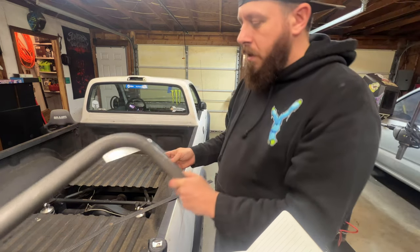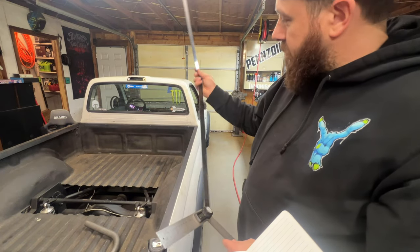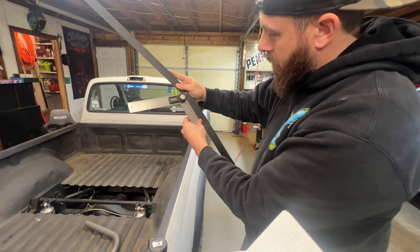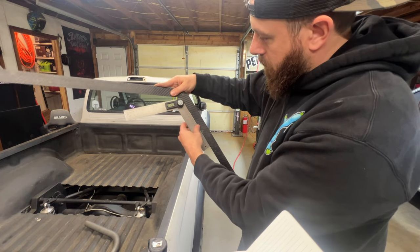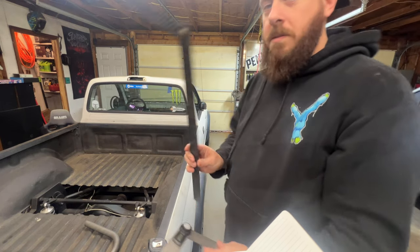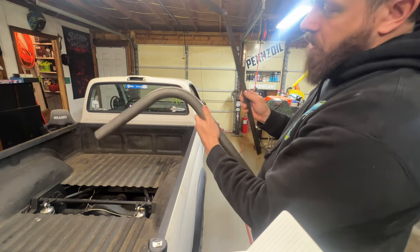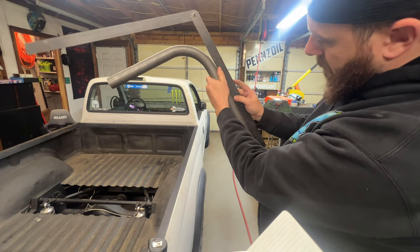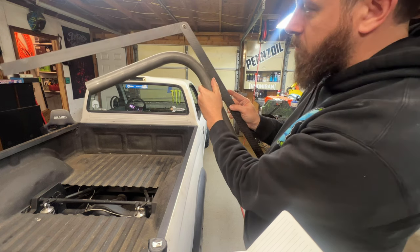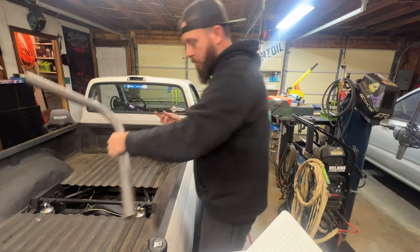So just to make it sit a little flatter, I have this longer piece, two pieces of carbon fiber with a bolt. Set it up. Now go ahead and match the angle so I know this is 72.5. Whenever I come in to do my first bend, I have a lot more flat surface area to make sure I'm true and not kind of tweaked a little bit. It's not completely necessary, but it's just kind of the way I like to do it.